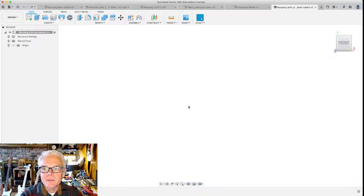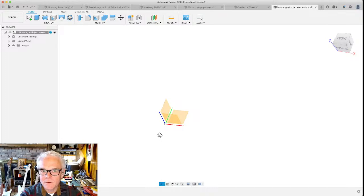This is it. This is the big blank canvas when you open up Fusion 360. And you can see that there's this cube up here. And if you grab it, you're actually rotating space. I'm going to reveal what the origin is. And there it's popped up onto the side of the screen. When we're rotating this in 3D space, and I'm just clicking on the scroll wheel and holding shift down to rotate, you'll see that the cube shows you the view that you're doing.